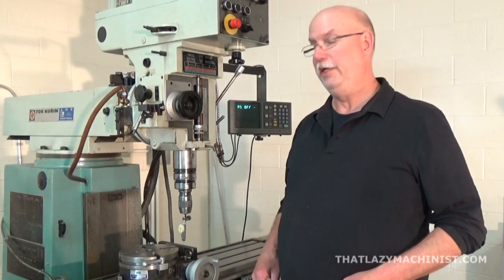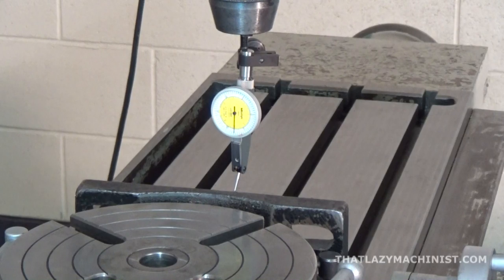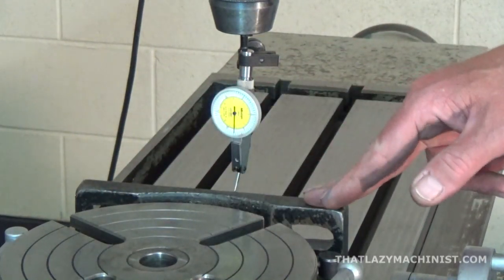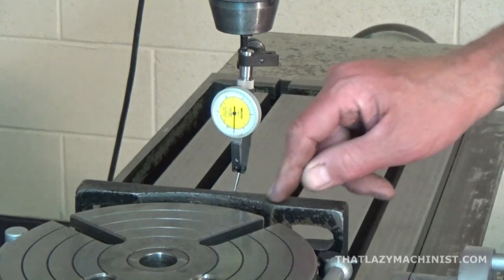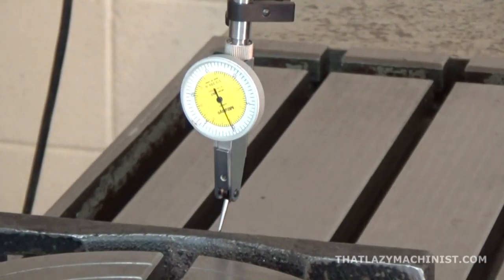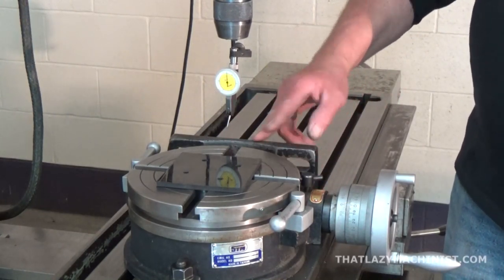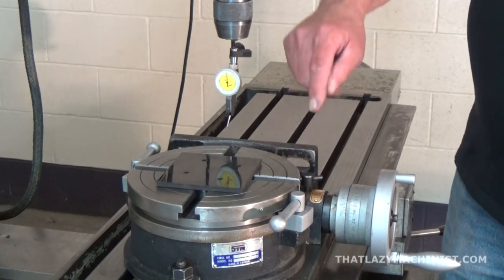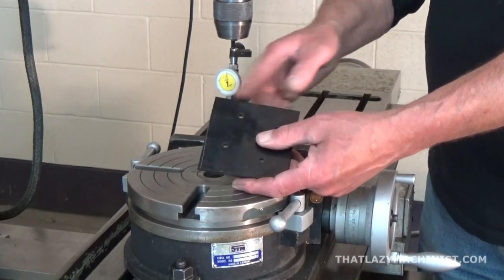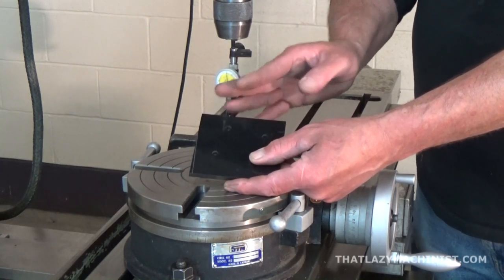The next operation isn't necessary in all applications, but I like things to be nice and square. So we'll start by aligning the base of the rotary table so that my scale reads zero when the table is perpendicular to the longitudinal axis. My base is aligned perpendicular to the longitudinal axis, my scale is set to zero, and I know where I am. Now I want to mill — just as an example — a 20 degree, 20 minutes, 20 seconds angle on this face of the part.